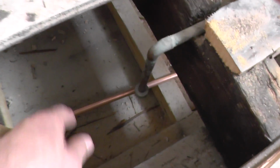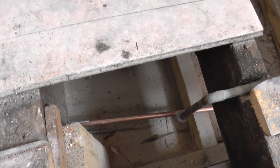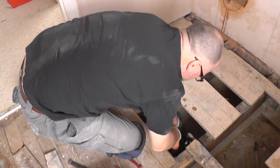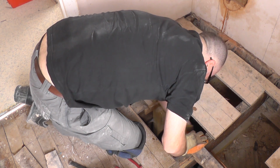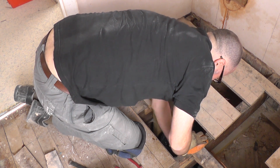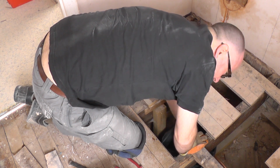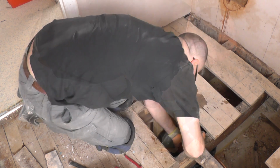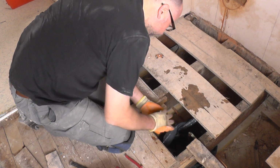And then with this pipe, I'm going to try and bend it. So rather than using another one of those, I'm going to try and put a bend in the pipe using a bending spring to see whether we can get the desired effect. Anyway, I'll get back to you in a minute. There we go, let's see what happens then. There's some water in there. It's a little bit of water in there. So, clean the end of that up. Okay, so that's beautiful, that brought it up beautifully.